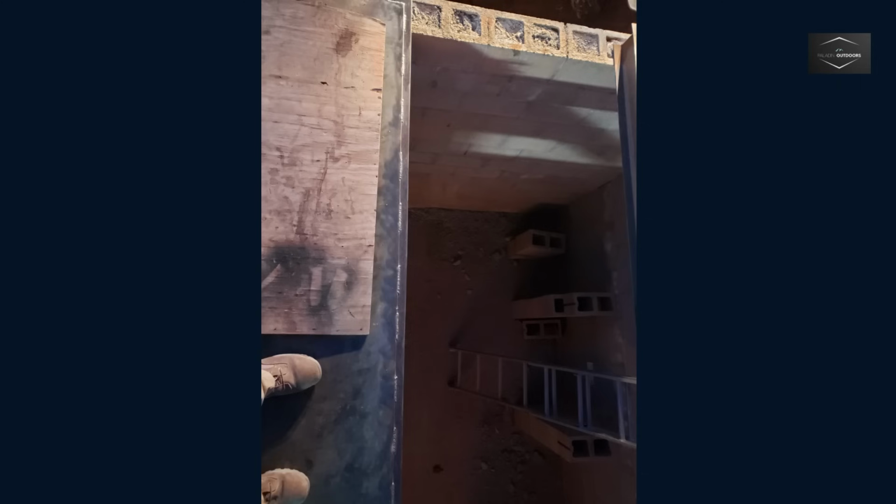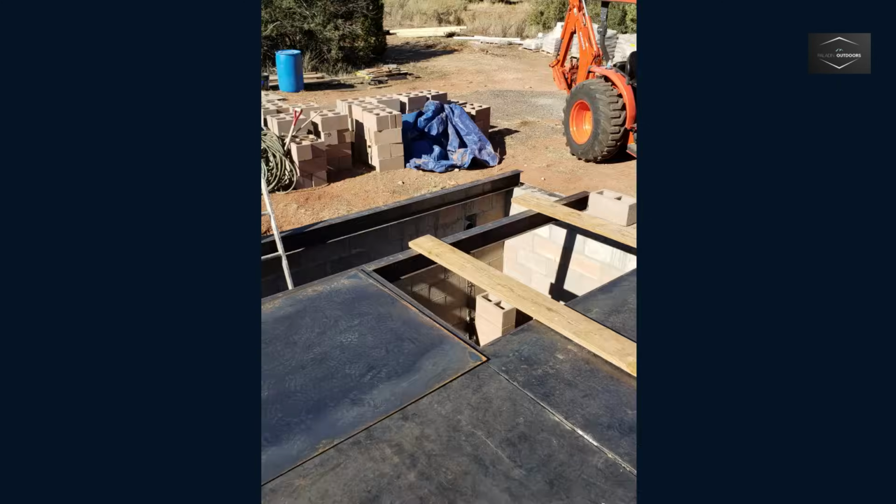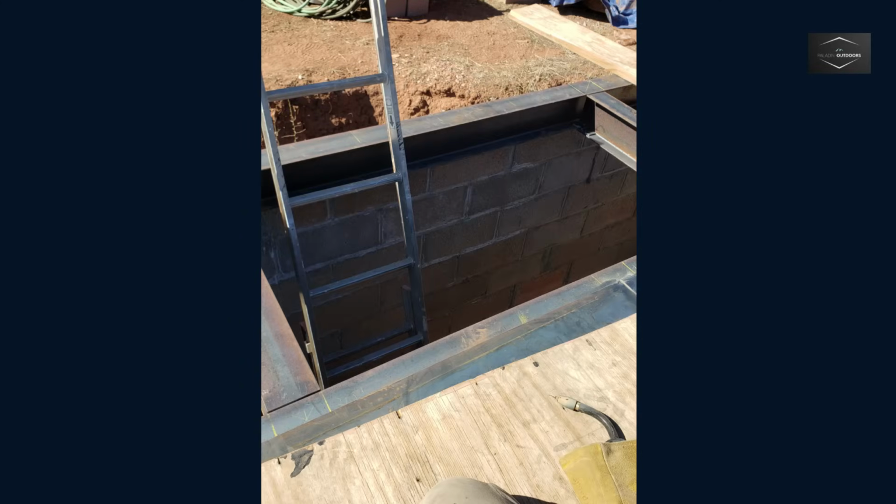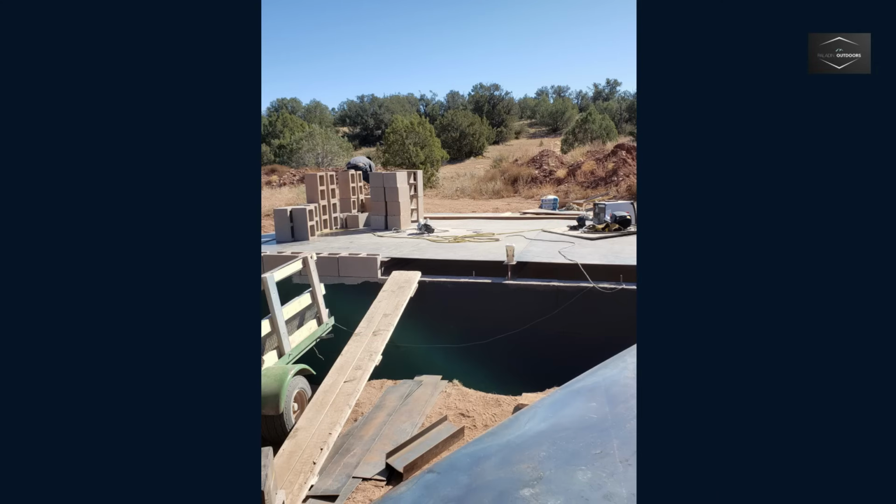I was having issues with the Hobart welder wire feed jamming. At first I thought it was due to flinching forward at the start of the weld, which would cause a wire jam. However, it turned out the feed wheels were slightly out of alignment and needed to be adjusted. I also learned certain flux core wire brands splatter a lot more than other brands. I ended up needing to upgrade to a heat-resistant cowhide leather jacket, as my Carhartt flame-resistant jacket could not withstand the splatter during overhead welding.